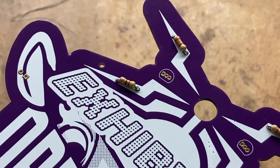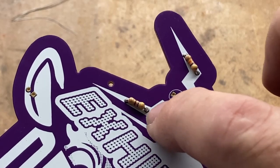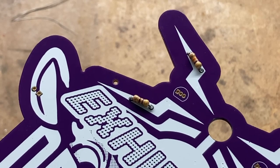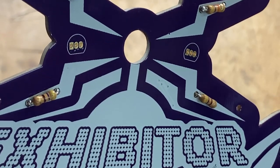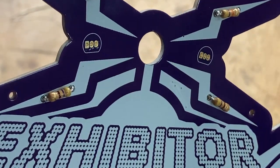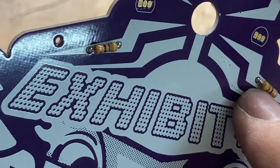We're just doing LEDs — it's not like we're doing high-tech radio work. But when you see that ever so slight little bit of solder that wicks through the other side, you know that's a really good, well-done joint. Whereas if you get one where the solder didn't wick through, it's possible that's a cold joint that didn't quite make a perfect connection. If you get something like that, just go ahead and warm it back up and reflow it. You can see there's a little bit of solder that came through there — that's perfect, that's what you want to see.